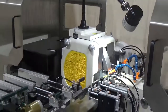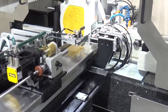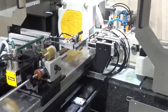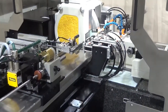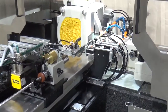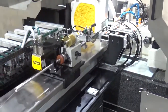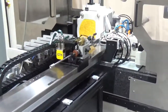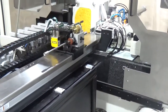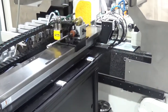If you have a three-meter long piece of raw material, you can make eight, nine, ten, or eleven pieces out of it and unload them. You'll have a small scrap end of about five inches or about 125 millimeters. It's a really slick way to make short cut-length wires. The machine also has a number of different compensation screens, including a custom offset screen for operators.